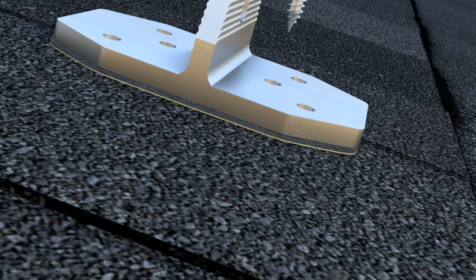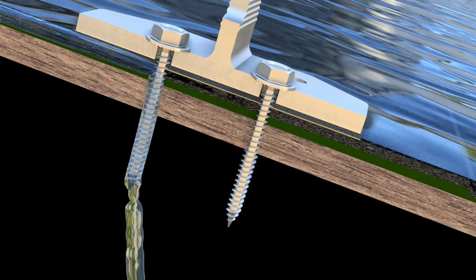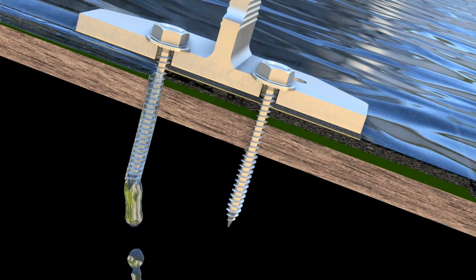The worst case scenario for creating a watertight seal is actually at the joint between two sheets of shingles, also known as the butt joint. The sheets form a slot canyon, a tight passageway that's too narrow for a butyl, foam, or EPDM to fill, and water flows right through. When this joint aligns with a rafter and a fastener goes into the slot canyon, water is channeled directly to the fastener and into the roof surface.